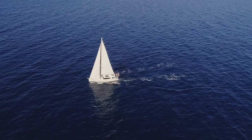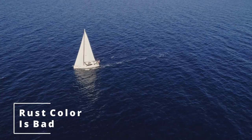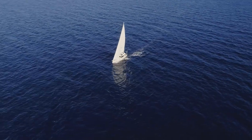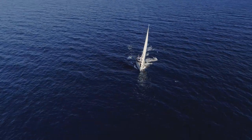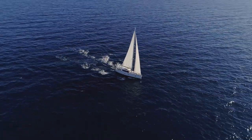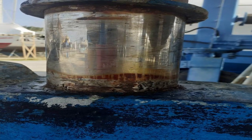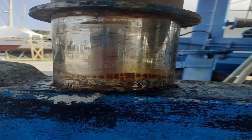Watch for continuing drips from the bottom after the hull has been pressure-washed and is dry. Feel the bottom of the rudder — if it's wet, wipe it with a towel. A rust color is a clue as to what's going on inside. If you own the vessel, you can drill one-eighth-inch holes in several locations on the rudder. These are easily repaired with a bit of epoxy putty. Water inside the rudder does not condemn it, but absence of water is reassuring. Also when you haul out your vessel, drop the rudder — it doesn't take much — and get a look at what's going on up top of the rudder in places you cannot normally see.